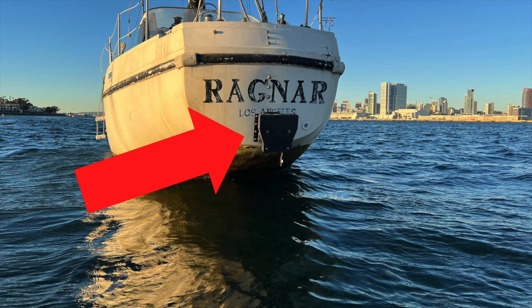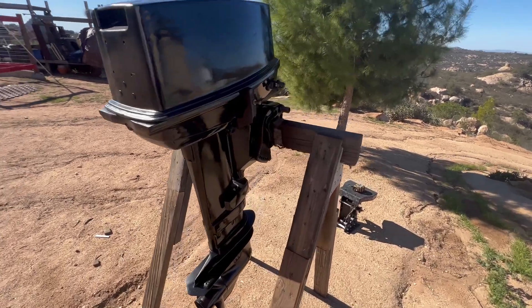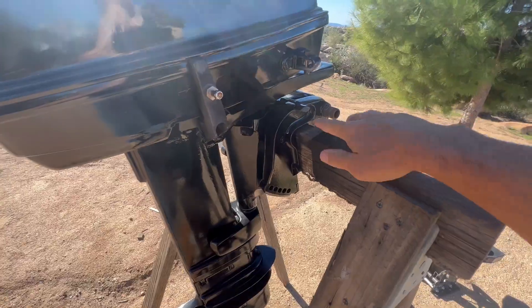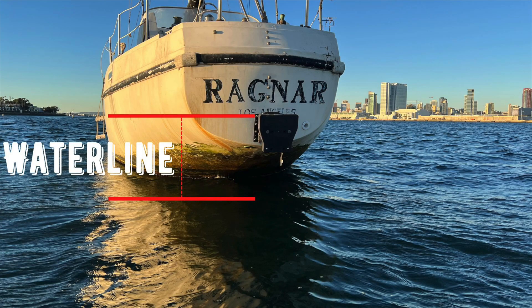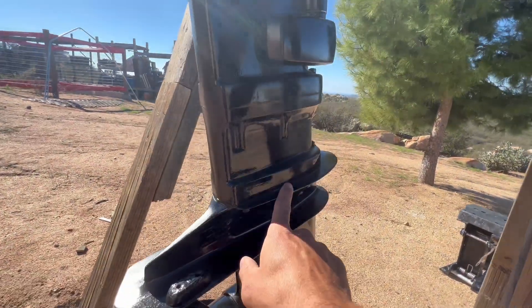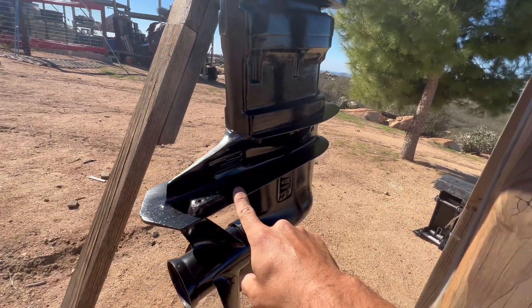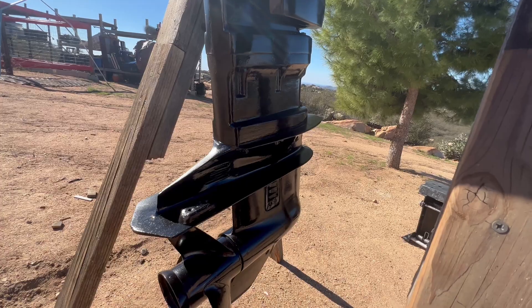You had a bracket and then you made another bracket for your bracket. Yeah, that's what I did. Let me explain. The Panther outboard motor bracket that I previously mounted on the boat unfortunately does not have the clearance that I need to mount the motor that's located behind me. The top portion of this bracket was sitting 30 inches out of the water. Here's my Johnson 25 two-stroke outboard motor that I'll be mounting to the boat, and this portion specifically is what I'm talking about. This portion is going to be sitting on this part of the bracket, so my measurement needs to be from this part of the bracket down until the water. When I had previously mounted this bracket, the top portion of the bracket was sitting 30 inches out of the water.